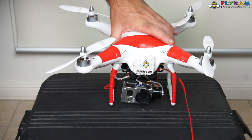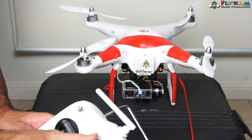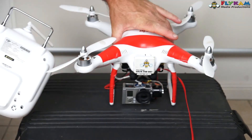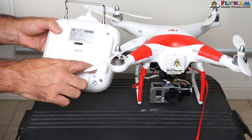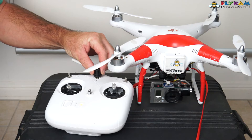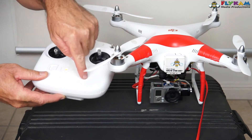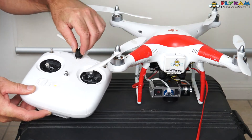I've also got my tilt setup. If I turn the knob you'll see the gimbal tilt. This is just a stock transmitter - I unsoldered the little potentiometer in the back, went and got a 5k linear potentiometer, drilled a hole, and ran wires from the potentiometer down to the circuit board where the original one was soldered. Now I've got a knob at the front.